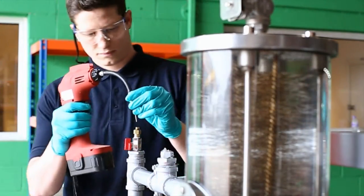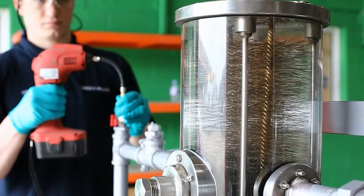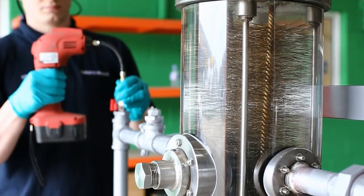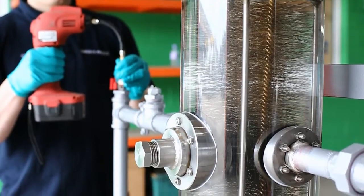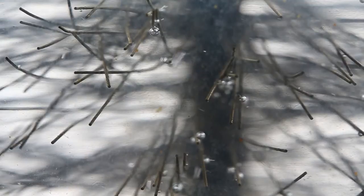The pipework and separator is completely filled with water. Air is then pumped into the system to demonstrate the filter's effective capabilities in removing air and micro-bubbles. It clearly shows air rising to the top of the chamber, where it will be automatically vented out harmlessly into the atmosphere.